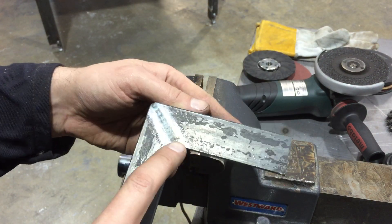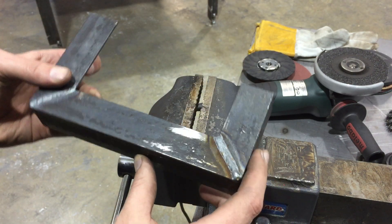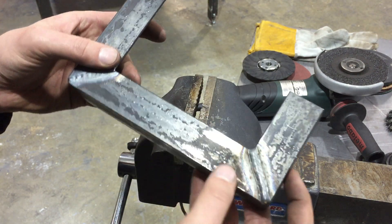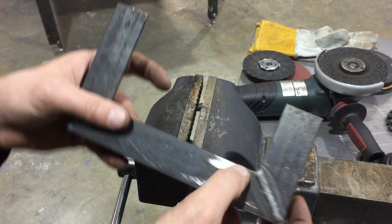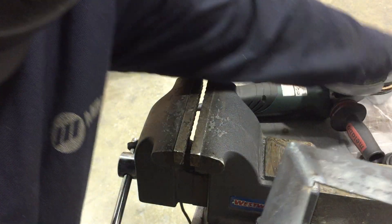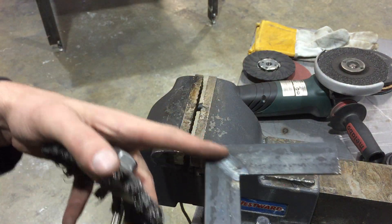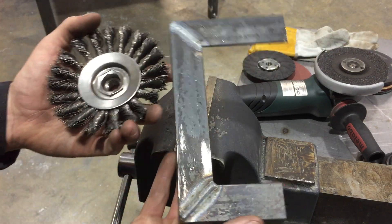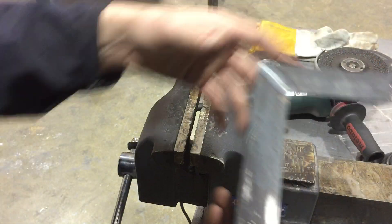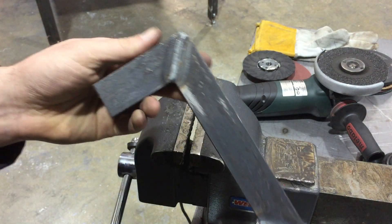You can faintly see — if I get the video shining right — that bright spot on either side of both welds. That bright spot is from taking down the mill scale before I welded. Especially with TIG welding, you want to knock off any mill scale, dirt, or gunk on your material and you'll always get a better weld. I just used a knot wire brush for that, but you can also use a light sanding pass. You just need to take it off in the area you're going to be welding.